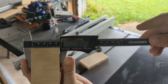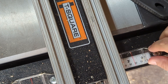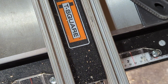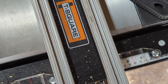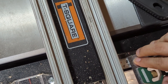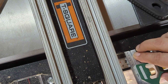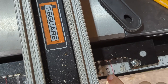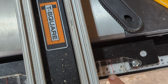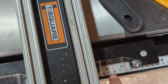So we're at 1 and 53/64ths. Where we're at right now is I tried flipping this over, tried every which way to get it, and I can't get it to where it'll go on the two accurately. We're a quarter inch off right now - my last block was exactly two when I measured it. So what I think I'm going to try now is take this, put it right on two, scribe it, and then color it in with a little pencil. Let me give that a shot. You can see our new line pretty much looks directly parallel with our other one - that one's a quarter inch off and that one there is exactly on. So I should be able to use either, knowing that one is a quarter inch off, or just look at the accurate one, or get it close with that one and then dial it in with the other.